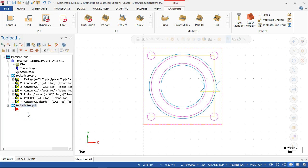So I don't really need to set up a unique work offset. If I needed a unique work offset, then I would be looking at actually flipping this over, setting a depth, or setting a new, basically a new plane on the backside with a distinct work offset attached to it. And I need a better example to go through.